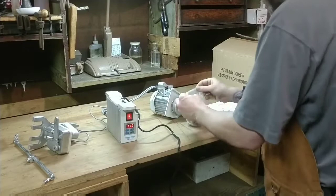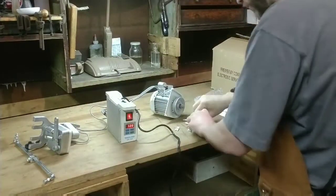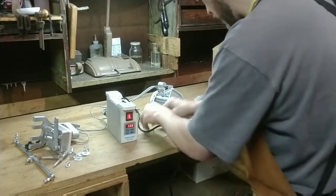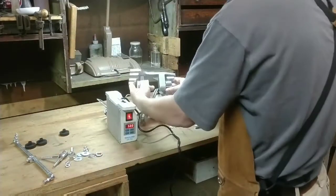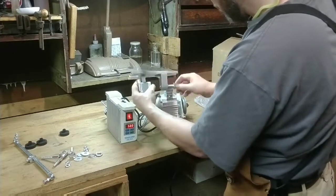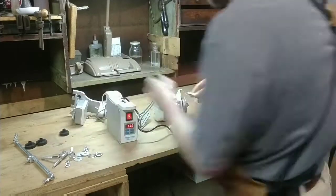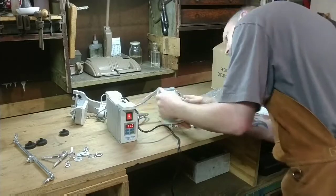I've had some experience with these little DC motors — I've got one on a little mini lathe. And when you are going slow speed it's nearly impossible to stall. You grab on to it and it'll just slow right down. It just seems to get more and more torque as it goes slow, which is perfect for sewing machines. All of the machines now have big industrial clutch motors on them.